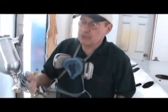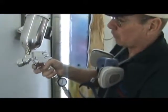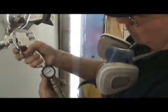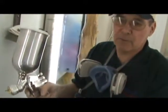We're in the spray room, getting ready to spray. We've hooked up the air, pulled the trigger on the first stage, and set the air to 22 pounds. Then we're going to open the fluid control approximately one and a half turns and see how that works. We're going to start on the bottom of the wing, do the edges first, stand it up and do the first coat vertically, roll it back over, do the edges again, then do the top. We'll immediately give it the second coat — one cross coat of primer is all this wing needs. Then we'll turn on the exhaust fan and get started.